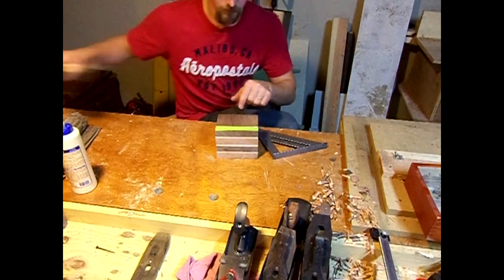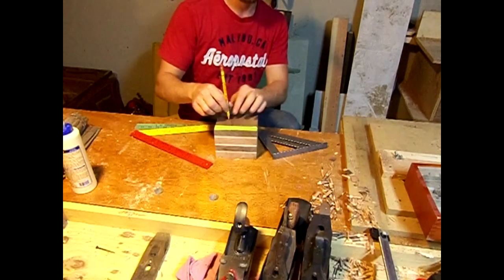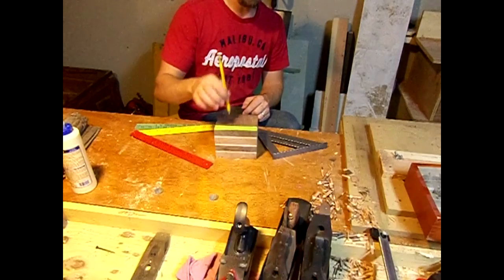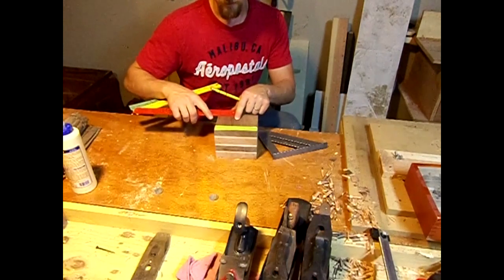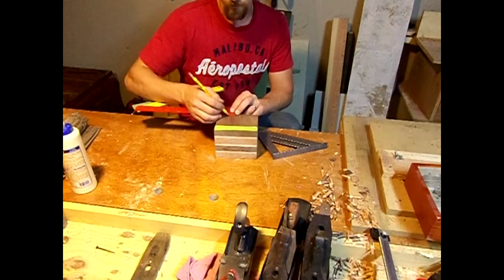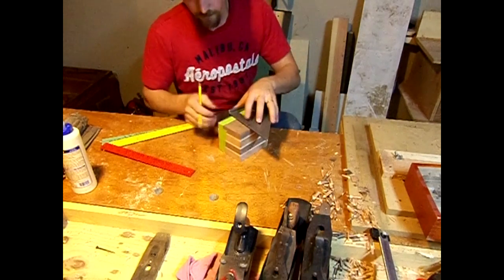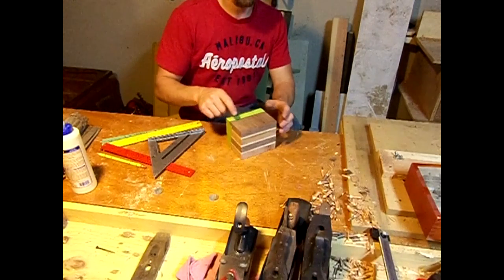The block width is four and a half inches wide, and I wanted two sections of it so that when my pencils get smaller, they don't tip over and fall to the very bottom. So I'll have one center section bar right there, and each section is going to be one and a half inches wide. I might even have pencils on one side and markers on the other. I found the center point and worked off of that — I've gotten my one and a half inch mark, so I'm going to take the square, draw a line down, draw another line, and head over to the drill press to get these drilled.